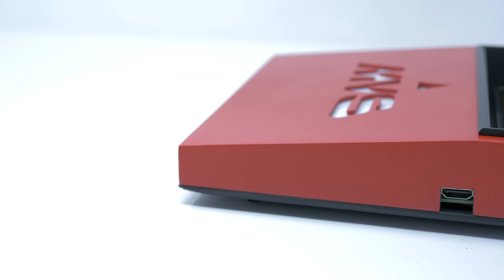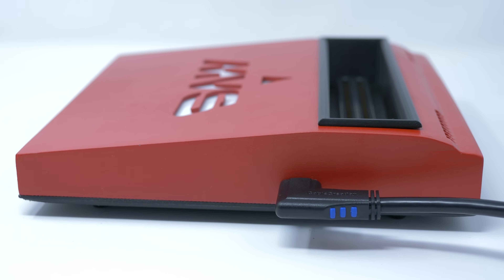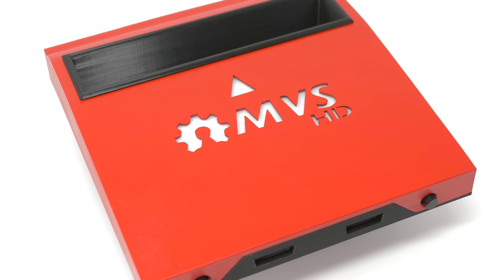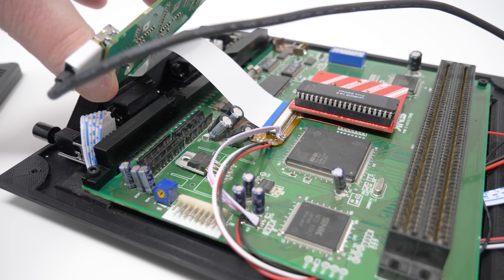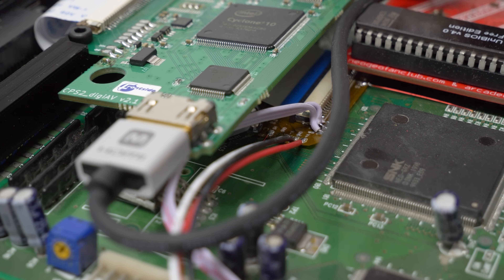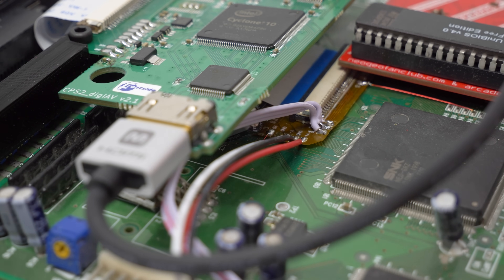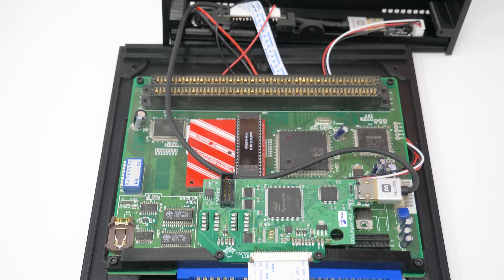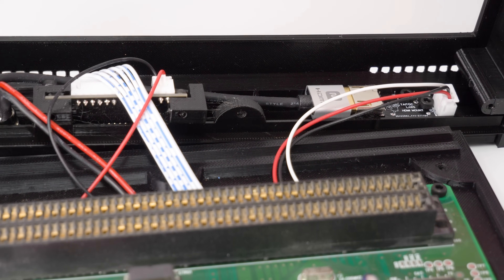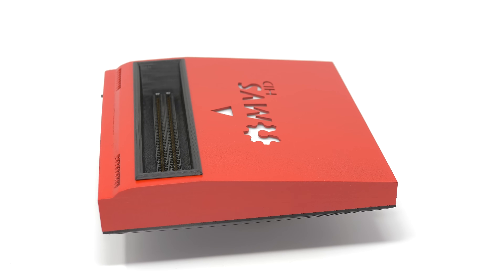For the physical installation, you could just mount the HDMI port to the side of whatever case you're using. This works well if you're modifying an original MV1C shell or existing Supergun case, and for existing OpenMVS users as well. If you haven't made or bought an OpenMVS yet, Abram makes a kit he's calling the OpenMVS HD. This mounts the HDMI board in a slightly different location using a custom flex cable and bracket. If you wire it yourself, make sure wires are as short as possible, and use a shielded coax cable for the clock line — wires that are too long will result in video signal dropouts, or it won't work at all. Abram also designed a new rear I/O plate that accommodates the HDMI port and settings buttons, while retaining full analog video output functionality — basically making it look like a factory HDMI Neo Geo.